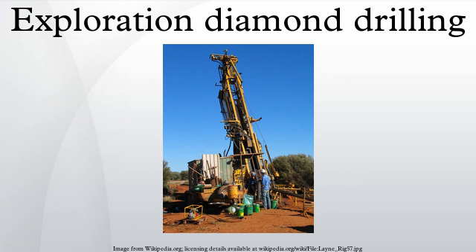Water is injected into the drill pipe so as to wash out the rock cuttings produced by the bit and also to reduce the heat produced due to friction, which causes less wear and tear of the bits. An actual diamond bit is a complex affair, usually designed for a specific rock type, with many channels for washing.